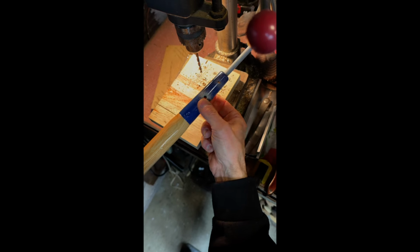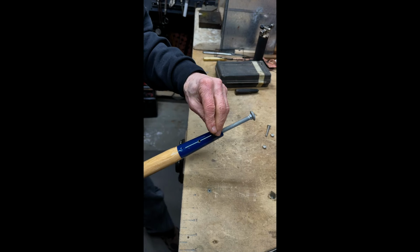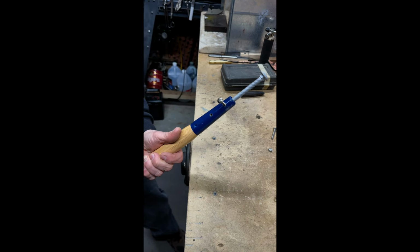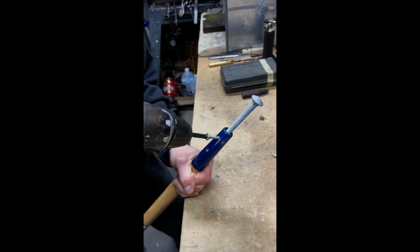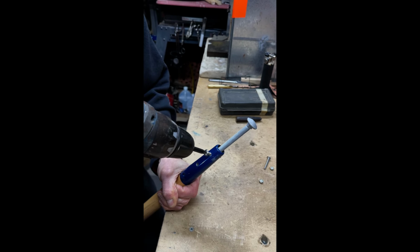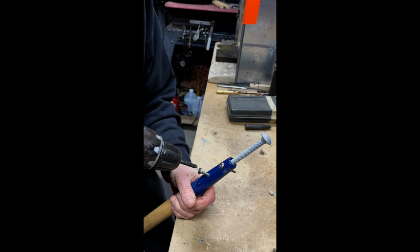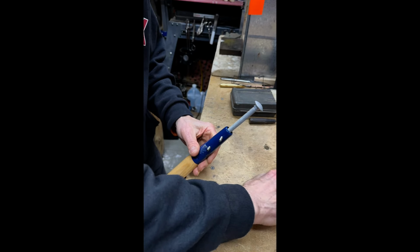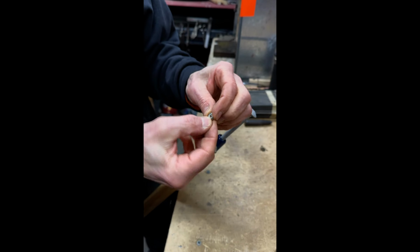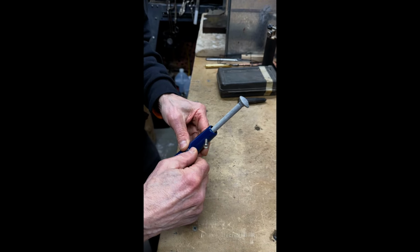We're ready to put the bolts in. Okay, so we've drilled the holes. Now we're going to put the retaining screws in. These are stainless steel. You don't have to use stainless steel. They were obviously more expensive than mild steel, but I thought I'd put them in along with the galvanized bolt. There's one. There's two. Now I've got nylock nuts, so we won't need any kind of lock washer or anything. Can put these fellows on.